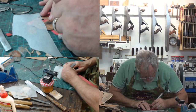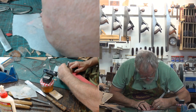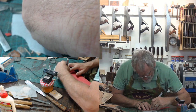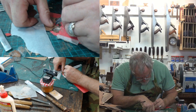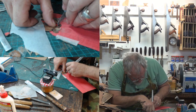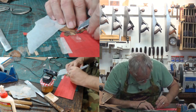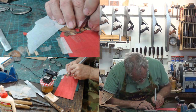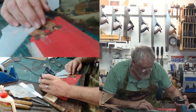It's not what I would call a spectator sport. By the way, this is another method of doing marquetry, only you don't actually use the piece as a template. You have a cardboard cutout, and then it's called the window method. I think it was developed back in the 60s. It does give you a very accurate fit. And as you can tell, it takes a bit of concentration.